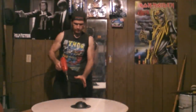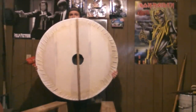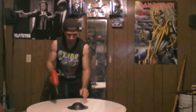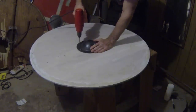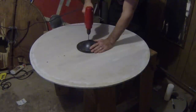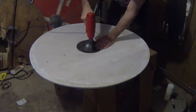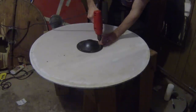Right here now, and we're going to drill the holes from the front side. We've already got the handle side. You saw how we do that. And the handle's on here very securely. It will not move, budge, or anything. And you shouldn't have any protrusions from those nails, because they should be flush. They should have been beaten into the wood. But be careful how you do that so you don't break your dowel. And that's the great thing about this, the lamination, you don't have to worry about wood splintering, splitting, or anything like that.